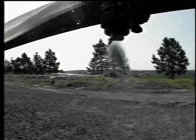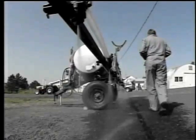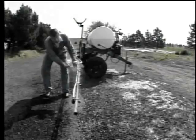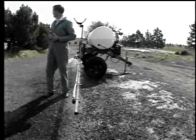Now that next one and the next one too would look all right, but look at that one there. It's just not putting out as much. Next few look okay. Go on down to the right boom there and you'll see, yeah, right there, that one's got a fouled up pattern. The rest of them look okay, John. Why don't you go around and turn it off?